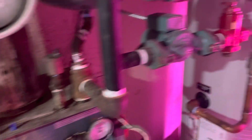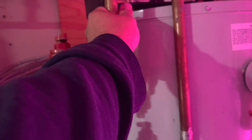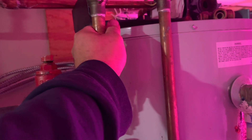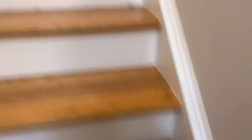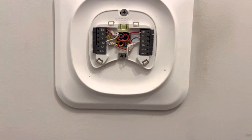However, we're not getting the third floor here. So it seems like he's got air in the system. But let's jump R and W and see if we can kick on that zone. I'm going to take RH and W, jump it out and see if we can kick it on. Here's my W.